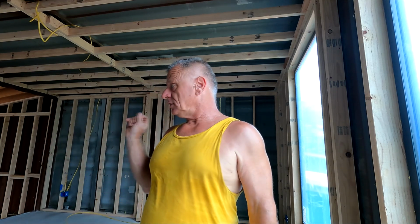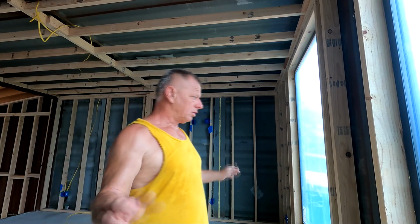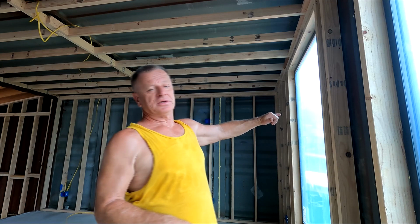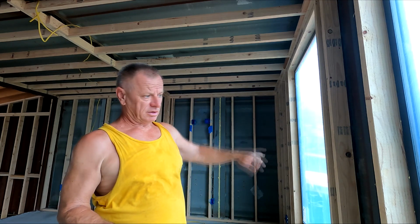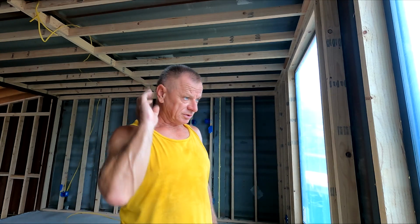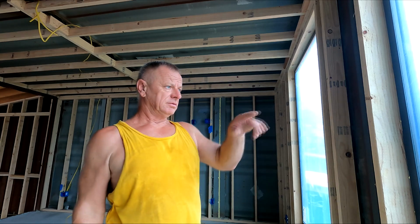And then the fun part begins, wiring the island, and then getting ready for little odds and ends that I haven't finished. Outdoor lights, we're doing a bunch of floodlights, basically master bedroom corner where the door is, 2 floodlights at the back of the wall underneath the overhanging container, and then 2 lights on the outside for the apartment and the office in the corner. Shouldn't be too hard. These 3 over here on the back side of the house will be on 1 circuit, and then individual circuits for the master and the apartment and the office.